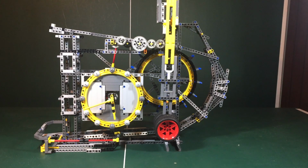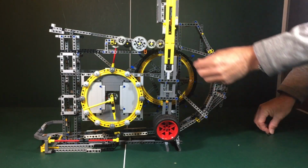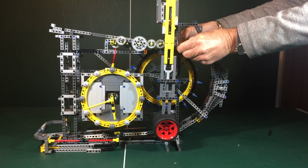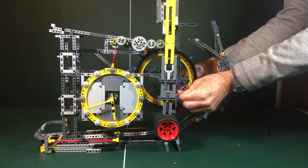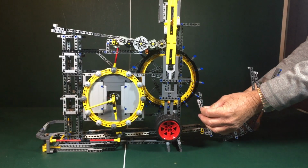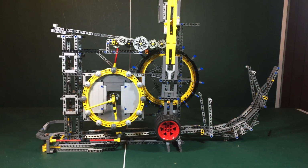Wrapped around the Ferris wheel is a ball guide that stops the balls falling out of the wheel. The design of this was quite tricky, as the rail system needed to follow a circle in space just larger than the sweep of the balls around the wheel. This involved creating some unusual angles in LEGO rails. The current solution you see works very well and has never lost a ball.